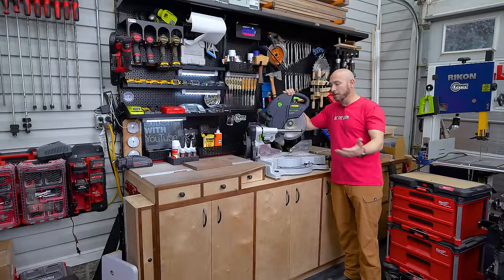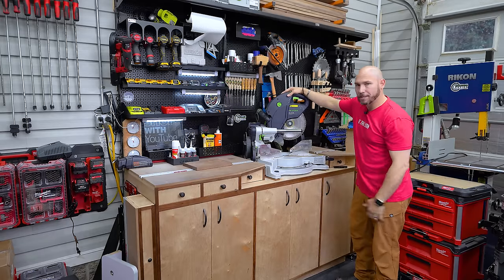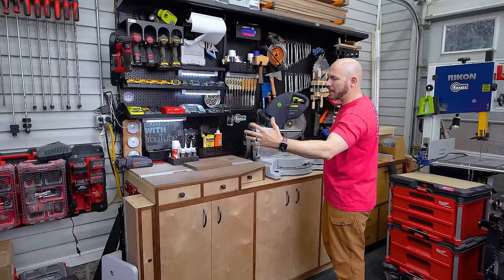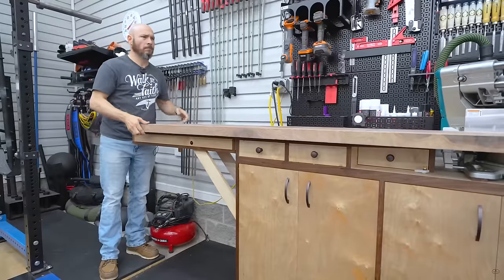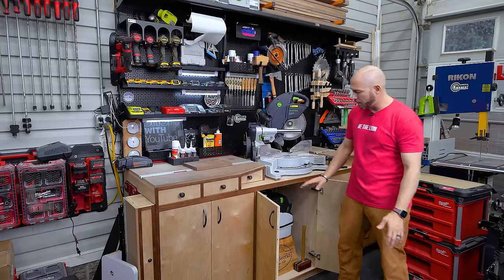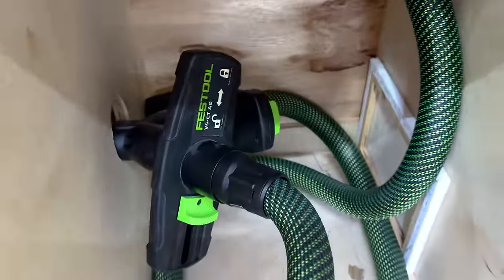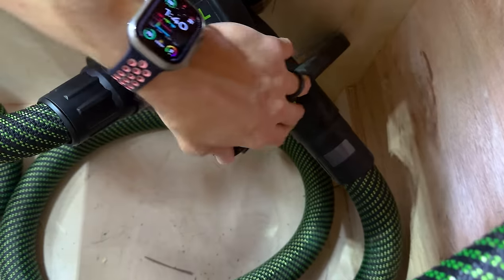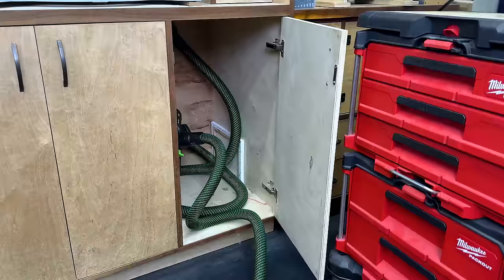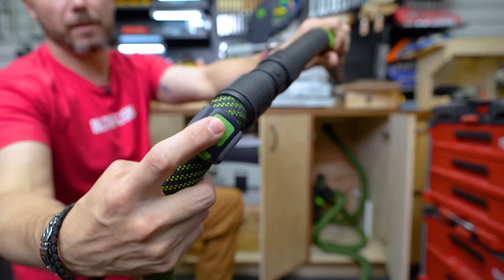As far as my setup goes, I'm in a shop setting so I wanted it mounted on a miter station. I built this miter station myself — I have plans available linked in the description. It's only six feet long but has a wing that extends another three feet for longer stock. I can house a CT36 dust extractor under here with plenty of room. I've piped the dust collection through to the side where I have an extra hose with a vacuum attachment, using a Festool splitter with blast gates so I can turn each on and off. I keep the extra hose off while using the saw, then switch over to vacuum up the floor — that's how it stays so clean. I literally clean up after every project.